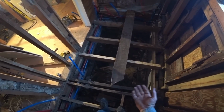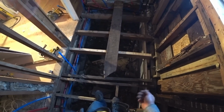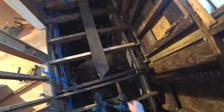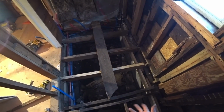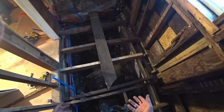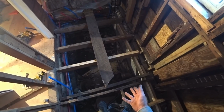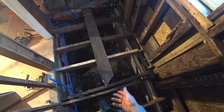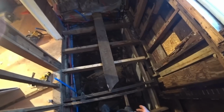The bottom of it was kind of rotted, and I was trying to hammer it off. It started busting apart, and I had to take a chisel and get it out of there. The elbow is very solid, so that's good and strong. So I have new pipe. It's like a PVC stuff that you put in. All the new houses use PVC, or ABS, whatever the pipe is called. They don't use this cast iron stuff anymore because it rots out and gets holes, and you don't want your poop leaking out, you know.